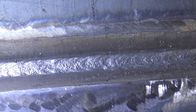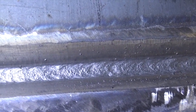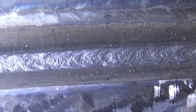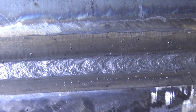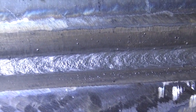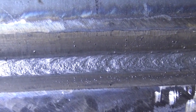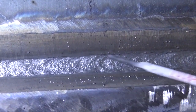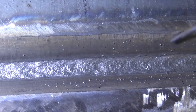It is super important that you keep a really steep drag angle — you've got to shovel the slag to the back of the puddle. Keep it all at the back of the puddle with a really steep drag angle so you're not trapping any slag. You can see where the needle scaler left its mark. What are you looking for here? Just no big slag holes and that the toe lines at the bevel edges are gone. You can see the bevel edges are gone — that weld is really tied in. These are really hot rods.